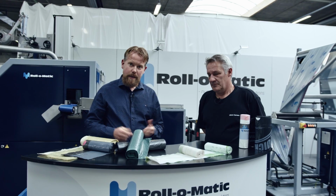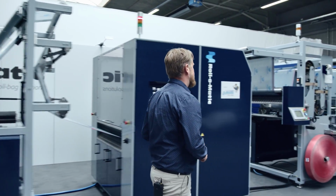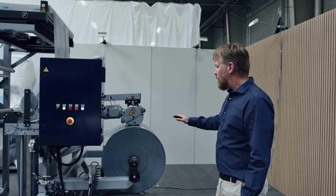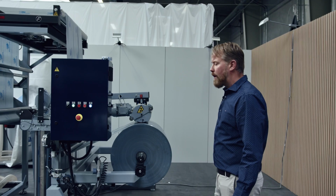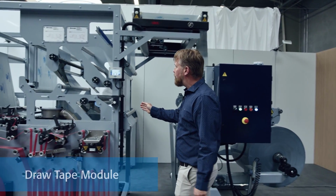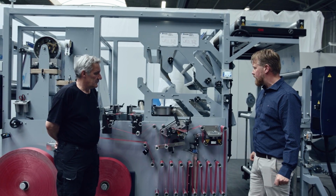Okay. Let's show the rest of the configuration for the line. Follow me. First we have the unwinder. We have the possibility of running with a tubular film where we cut it open on one side with a cold knife. Alternatively, we can run an open-sided film as well. From the unwinder, we move on into the draw tape module. This is where the hem is being placed in the actual bag.